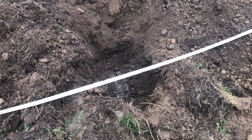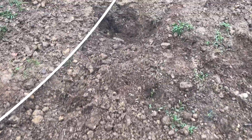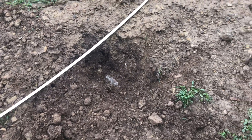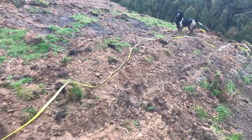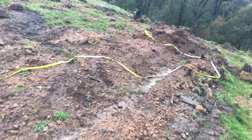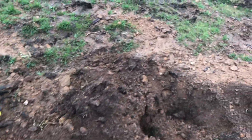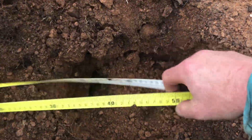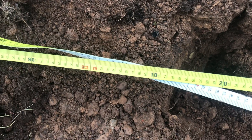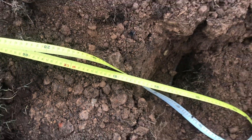There's easily 100mm of coverage here. Same there. In the lowest spot that we've got, there's still 100mm of cover. Taking this all the way through to the end of the drain field trench — that is just over 23 meters. So four of those takes us over the required 90 meters.